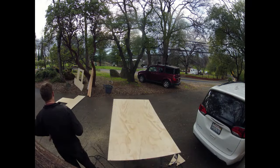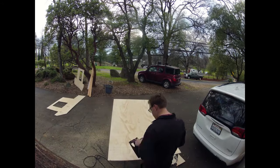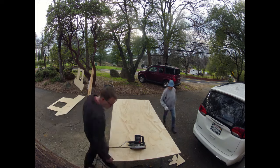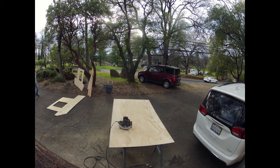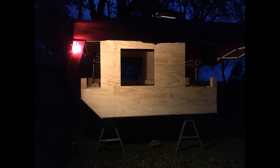Now I'm cutting the bottom of the boat — it's just a single sheet of plywood with a little 45-degree cut on the front. When it comes time to connect the two sides, I'm going to use a 2x4 as a cleat, with lots of glue on the 2x4 and lots of glue on the side of the boat. The two sides will be glued and screwed together, producing a nice watertight connection. The bits I'll use to tie up the boat are 4x4 posts that extend down into the hull and make that watertight connection between the bow and the side.